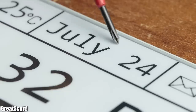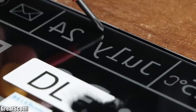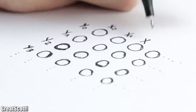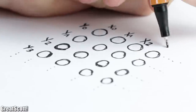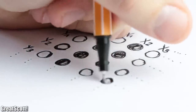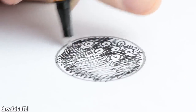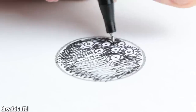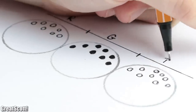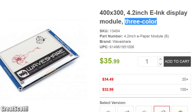To prove this, the black and white color on the front side of an ePaper display should be inverted on the back side, which is correct. All those capsules are controlled by an active matrix in order to display the intended picture — that is basically the working principle. Sometimes there are variations, such as having only white particles suspended in a black polymer, or having colored particles or color filters to create an RGB ePaper display, which you can also easily order.